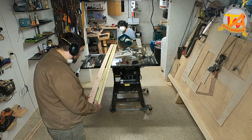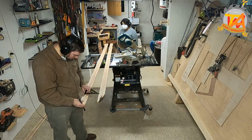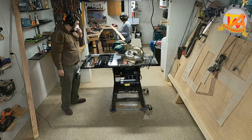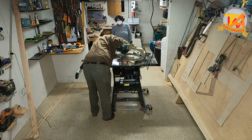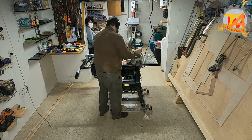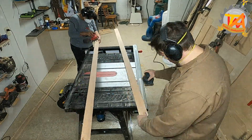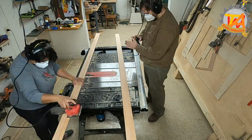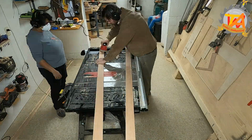We did a brief cleanup, then we set up the miter saw. Next step was to measure the exact length needed for both the strips to frame the flooring. Then we put 45-degree miters on one end of each strip. Moving around 8-foot boards is a little much for my shop, but we were able to manage it. Last but not least, we gave both the strips a thorough sanding. We sanded the top surface so it became a nice, smooth, rounded top.